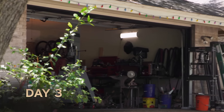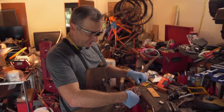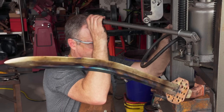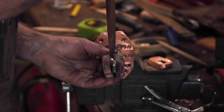I'm a little tired, but nothing some good coffee won't cure. I got an octagonal guard knocked out, and I'm going to mix some epoxy and set some pins. My plan is to put the butt guard on and use the press gently to conform the metal over the groove and lock it into place for a physical connection. I go to the press — it feels like it should just press into place, and it immediately goes south. I break my handle. I noticed the handle's screwed up, so I've got to pry it off, clean everything up, re-epoxy, and re-pin everything.